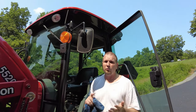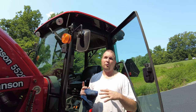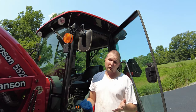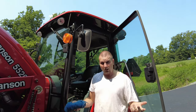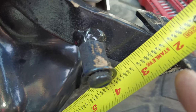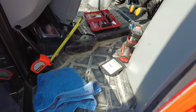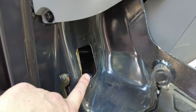After we got this back down, I'm going through a couple checks in the book. One thing is checking for free play in the clutch and brake pedal. The brake pedal free play seems good, but the clutch pedal seems to have a little too much. In the book it's specified between 0.1 and 1.4 inches of free travel before the clutch starts to engage. Measuring it now — about three-quarters of an inch of play — so that's actually fine according to the book.